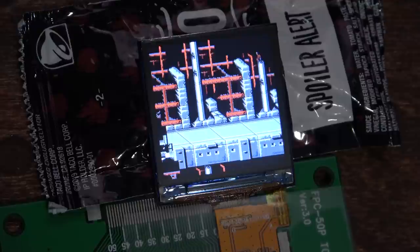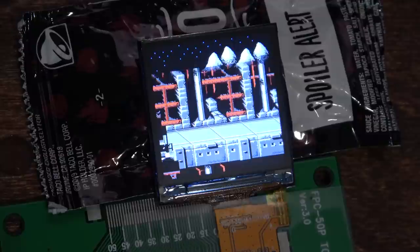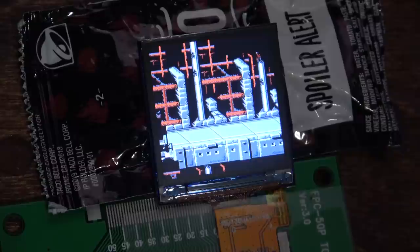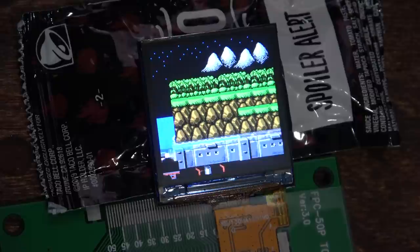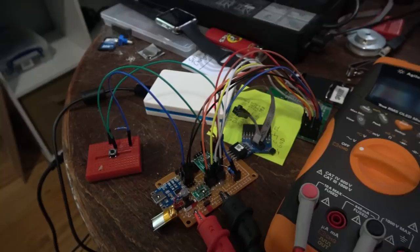All right. How many screens? Well, it should be 5K. Pretty sure this thing only has 16K of flash. Kind of disappointed that the compiler doesn't actually take that into account. Oh, yeah, sure enough. I tried to add a third screen and it said, whoa, no more s'mores. No more s'mores. I thought about trying to make this in one part, but this part is already too long.